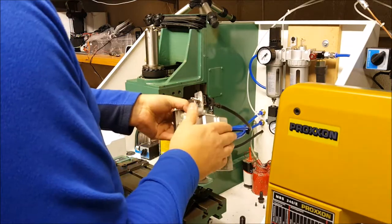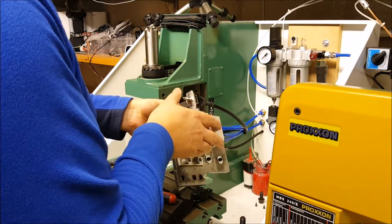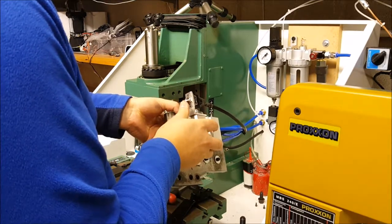This is a soda stream bottle — all I did was cut the top off, drilled and opened the hole up, and tapped in a standard quarter-pipe thread fitting, just as a bit of a reservoir so that when this thing kicks over it doesn't drop pressure too quickly.